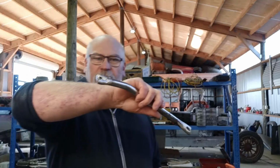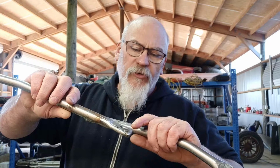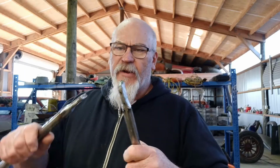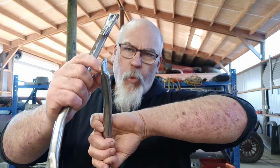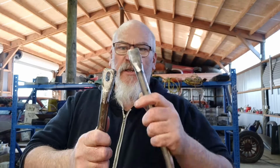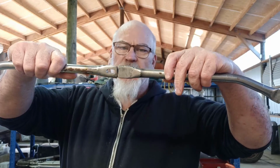So I've got this one here fairly complete. I've still got to do some tidy up, some re-welding, because of this tube. I'm trying to make it light but strong without using full steel rod, if you know what I mean. I've been layering up the end with a piece of steel that side, steel that side, welding it all the way around, then grinding it down and cleaning it up, and welding it across the end, obviously, and then drilling some holes in it and trying to get them as square as I possibly can.